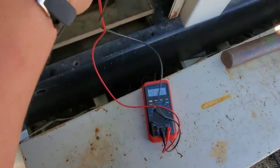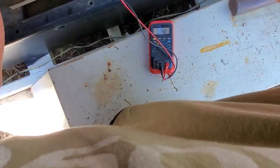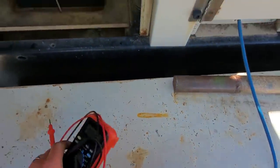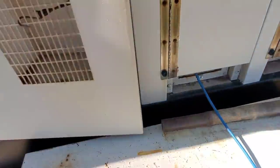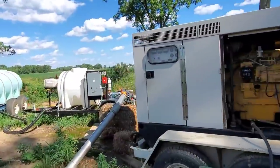I'm sitting here at the generator after putting fuel in. I think it was yesterday I checked the voltage on the alternator — we were getting 14.75 volts — and I'm getting the same right now. A lot of you said to check it at the batteries or at the back of the gauge, so I came over to the batteries. We've got 14.75 at the alternator but only 13.42 at the battery. And yet my gauge still says ten and a half — what's going on?